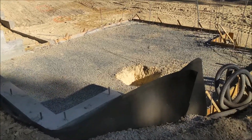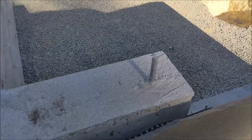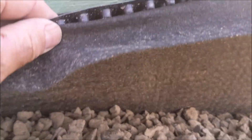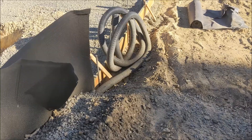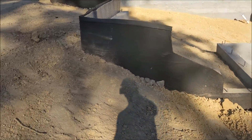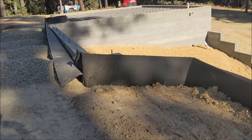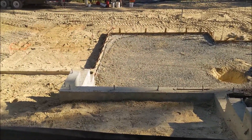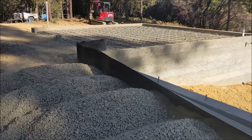Down in the basement, that also got cleaned off and backfilled with rock. We also water-sealed the uphill side of the stem wall. It gets a waterproof paint painted onto it, a felt, then that dimple board to keep the water off, another layer of felt. At the bottom there's a perforated pipe to take the water out, then backfilled with crushed rock. This was not called out on the plans but seemed like a good idea before all the dirt got backfilled against the foundation. Freedom Concrete did a beautiful job water-sealing it — maybe overkill, but the last thing you want is water seeping through the concrete into your basement or crawl space.